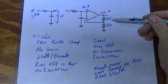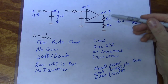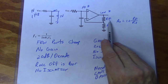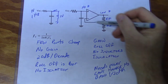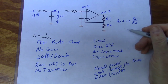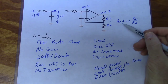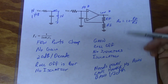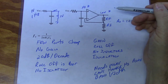Overall, the active op amp is obviously the preferable choice. We have gain, we can adjust the impedances giving us isolation between input and output, and by using more RC networks we can improve the roll-off. Limitations: it needs power, bandwidth is limited, and it can't handle a lot of power.